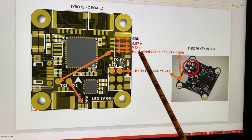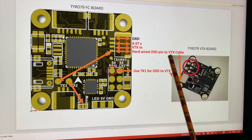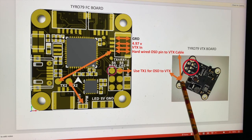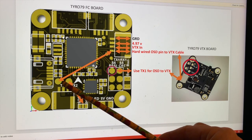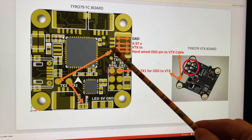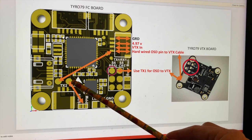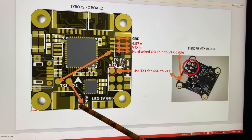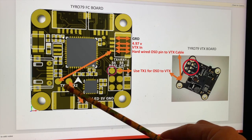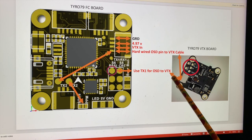The end part of the VTX board — what I found is that the OSD pin going to the VTX through the cable, the fourth pin over, is actually hardwired to TX2. I did a multimeter check for continuity, and those pins are the same. So in effect, if you're going to be using RX2 as your RSSI or transmitter signal, it's also forcing you to share your OSD or smart audio through this pin to the VTX.